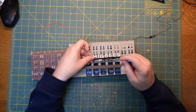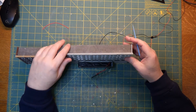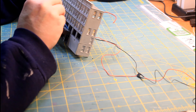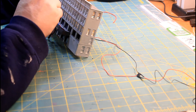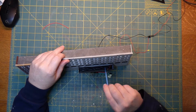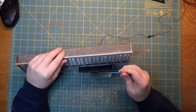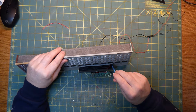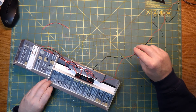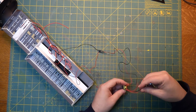I have to re-solder this wire — I'll do that in a few minutes. Looking down, I drilled two more holes. If you remember, we have the lights that go underneath here which light up the underside of our canopy. I took electrical tape and covered up all those connections so I don't have to worry about shorts going on in there. Then I connected these and ran two wires to power. I drilled two more holes down here and ran them out the back side, and that comes over to our transformer that we talked about last week.